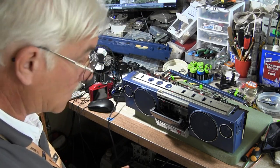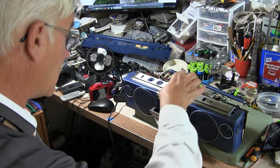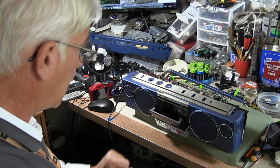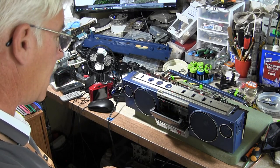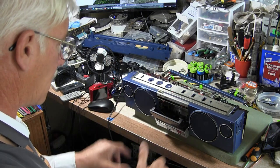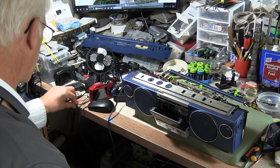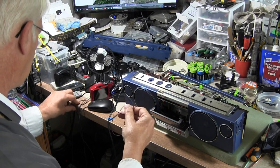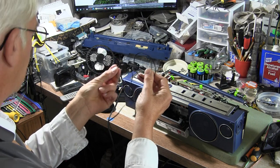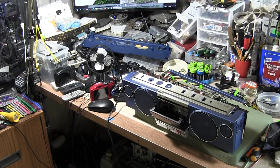I still have this Iowa — this Aiwa CSJ-50 — here to finish, which I put on the back burner because I wanted to do this one. But this CFS-F10 — I'm going to go back into the tape deck one more time and see if I can understand what makes the take-up reel rotate and if I can repair that. If not, I'll put it back together and sell it as-is: radio works, tape deck has all new belts. Here are all the old belts. Anyway, too much fun — good day, thanks for watching, bye bye!